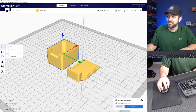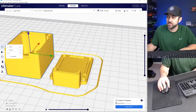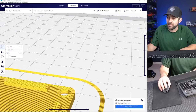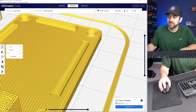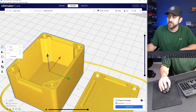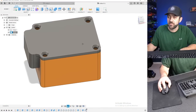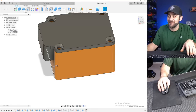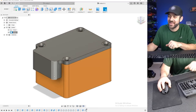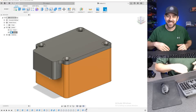So that would be your 3D print file exported and ready to print. Everything looks pretty decent — we've got three shells, a little bit of infill. So our three-millimeter width was just fine. It's good to go. 3D printing makes you lazy in some ways. If I'm designing for machining versus 3D printing, there's a lot that changes — a lot of people don't understand it. Like when they say 'oh, I'm great at design, I make all my own 3D printed stuff' — it doesn't necessarily transfer to design for actual products and actual manufacturing.